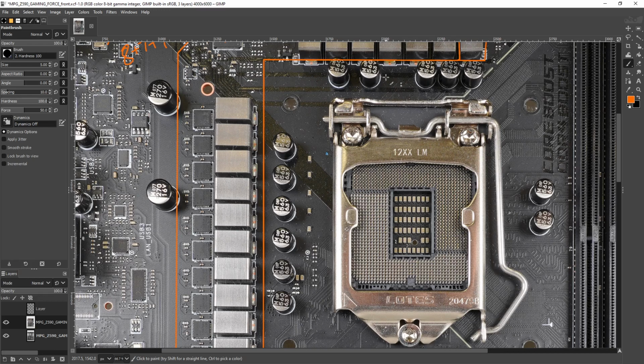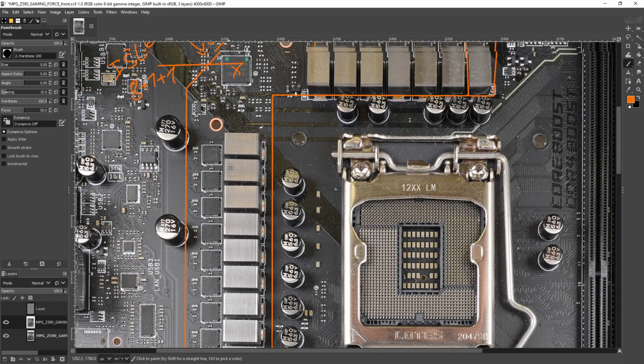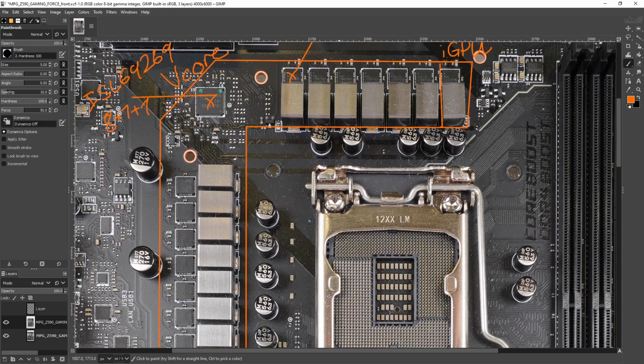degradation of the CPU. But in order for that to actually be a concern with overshoot, you'd have to be looking at ridiculous amounts of overshoot, way, way more than what you'd be getting on a board like this from MSI. That's why when I do voltage regulation testing, I just kind of gloss over the overshoot figures.